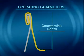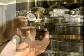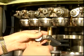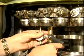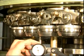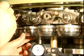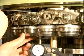The only way to do this properly is by using a roll height gauge. The gauge is put into position between the chuck and the lifter, then opened up to deflect the lifter down, thus simulating a can under load during seaming. The roll is adjusted down to lightly contact the chuck, and then raised to typically 0.076 mm for first operation and 0.152 mm for second operation.